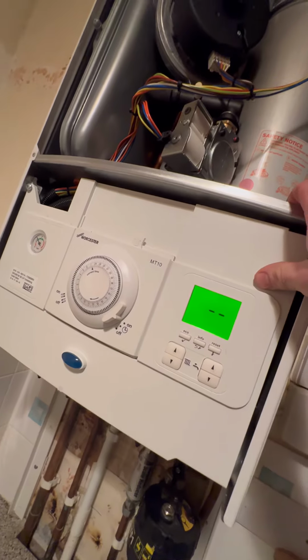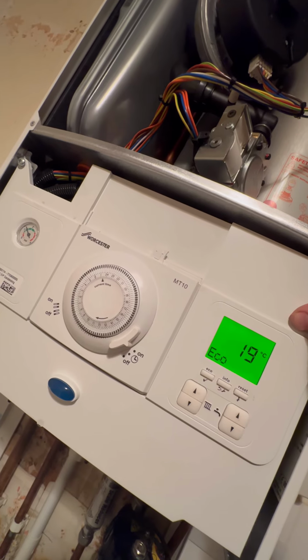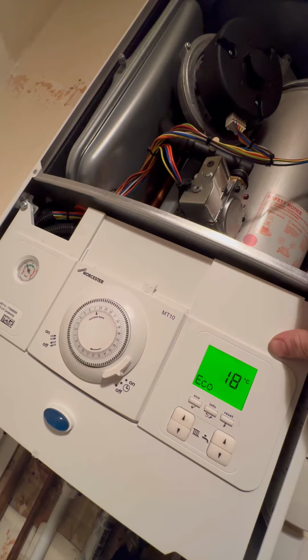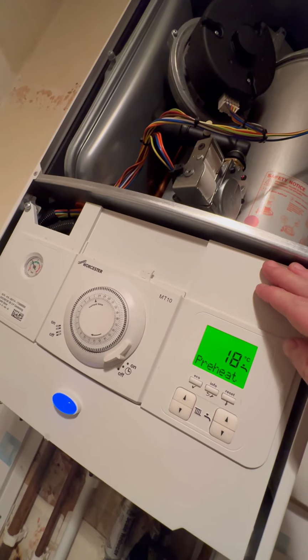That sounds better straight away, it doesn't sound like a washing machine anymore. The reason why it sounded like a washing machine is because the water's backed up into the heat exchanger, well, into the burner, and the fan's pushing down onto that water, creating all the bubbles and the washing machine sound. Anyway, get this tested. No, I'm alright, thank you.